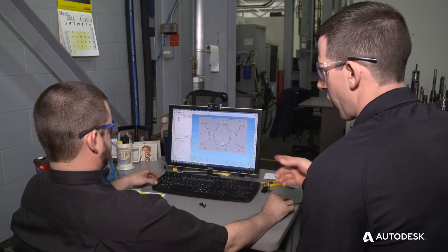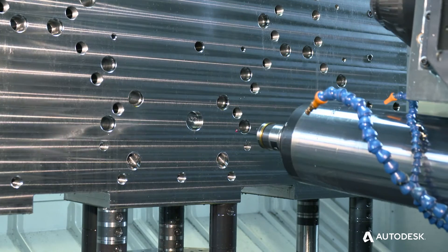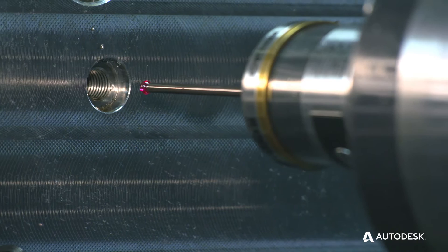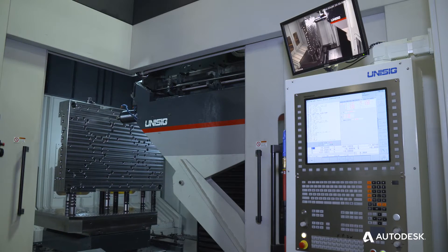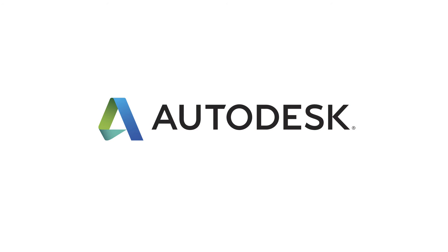The support has been great, the experience has been good, and we're starting to get real good results now. It only made sense for us to also inspect and verify parts running G-code on machine tools, as opposed to running it through very expensive and very specific CMM devices such as the ARM or even more expensive DCC controlled CMMs. Obviously CNC machine tools and CMM inspection devices are comparably priced, so why not make your CNC machine tool work for you from both a machining and an inspection verification standpoint.